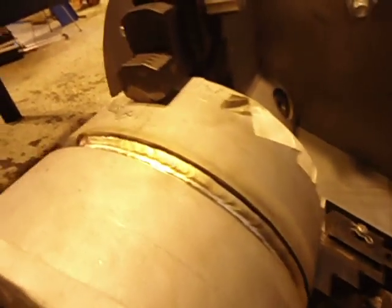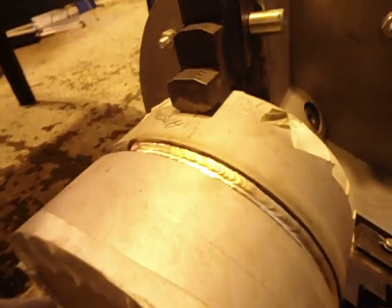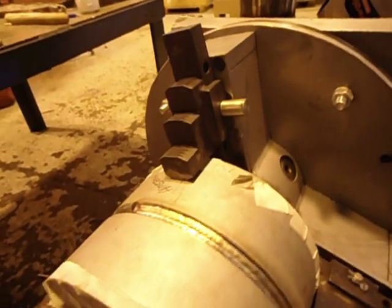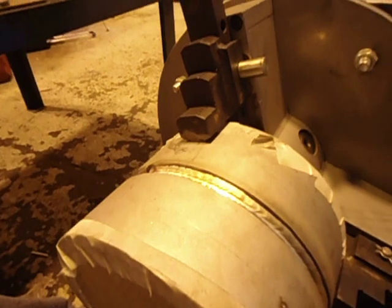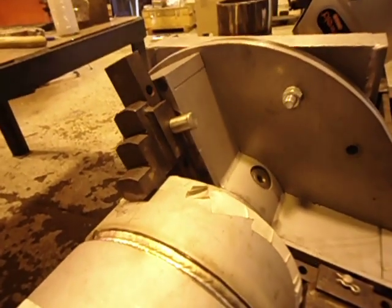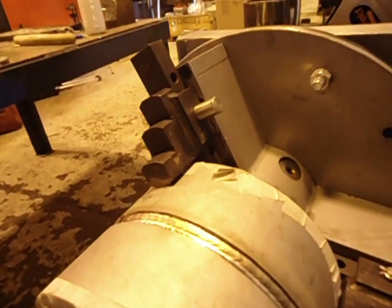It's gorgeous. No spatter. You don't even have to touch that with a brush when you're finished. Now if it was me on a job like this, feel the pipe with your hand. It's cold, isn't it? I'm going to say the interpass temperature is about 300 degrees. If it does build up on the second pass, keep it under 300 degrees — you'll always keep that lack of oxidation in that weld.